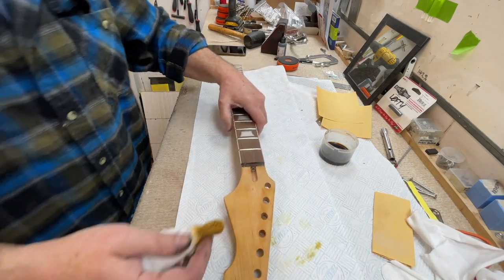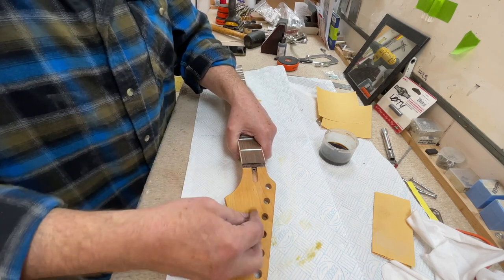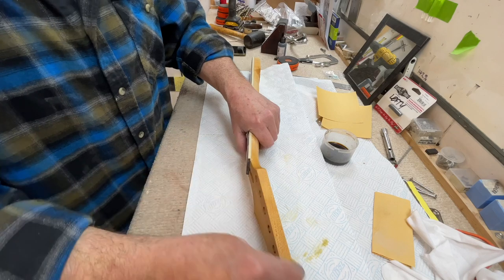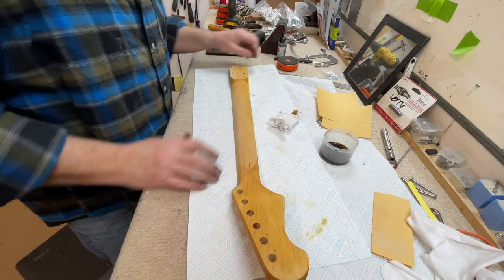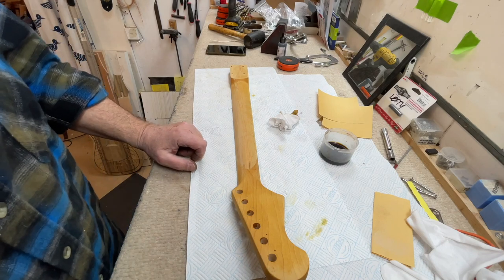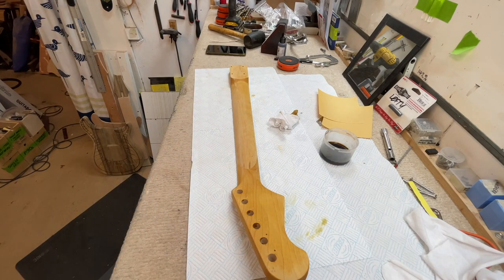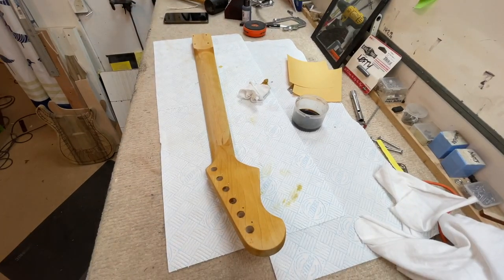So another approach I might have taken in the past with necks like this is to use water-based poly. And I've used water-based wipe-on poly in the past. It's been fantastic. Very difficult to buy the particular kind here. It's Minwax that I've used. But there are a lot of people in the forums that teach you how to make your own wipe-on, rub-on polyurethane, pointing out that it's basically thinned down regular poly. So I'm sure it's worth doing lots of experiments, but I'll show you the one I use, if I can remember. It's this one.